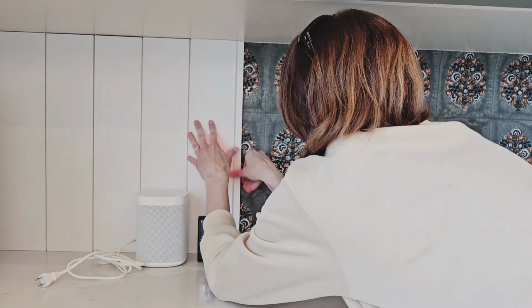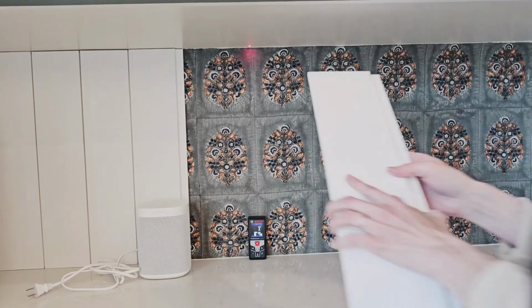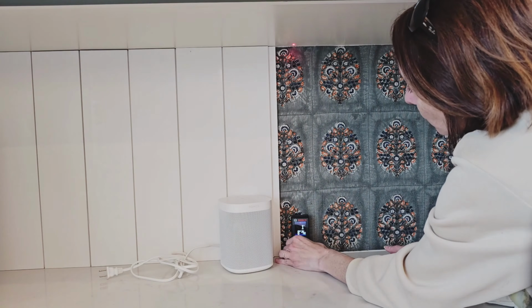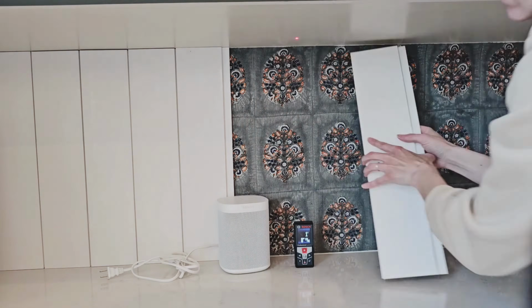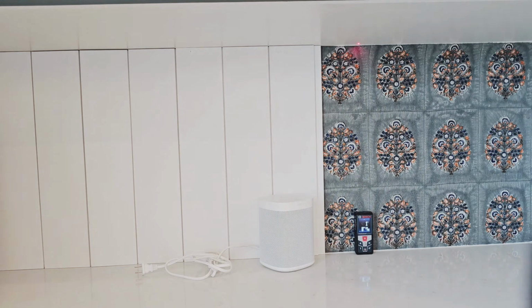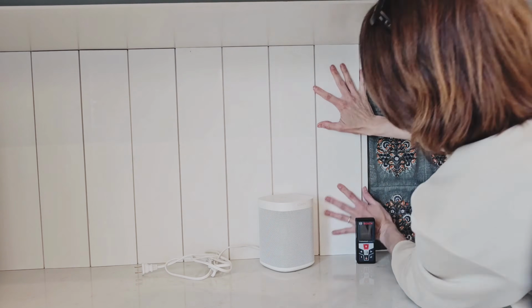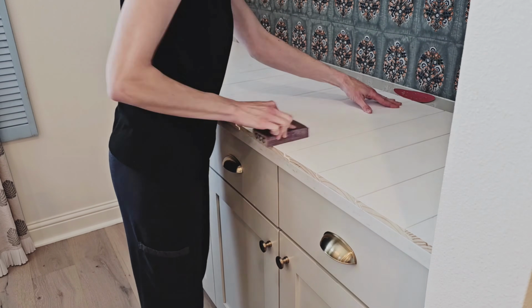So I decided to go with a backsplash of shiplap vertical, and I'm using this digital measurement tool, because nothing is square in this new home, and so I'm measuring for each piece of shiplap board, and some of the boards were the same, but I'm also numbering them so that I can keep them in order, because the boards on the far left are not going to fit the wall on the far right.